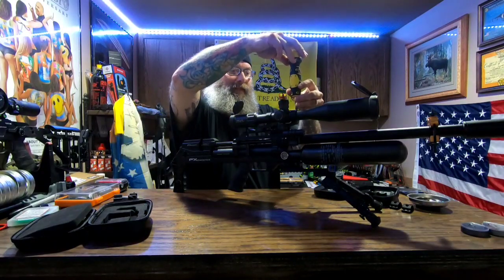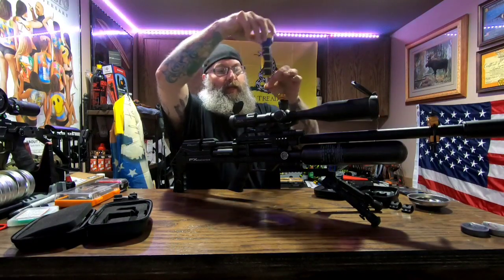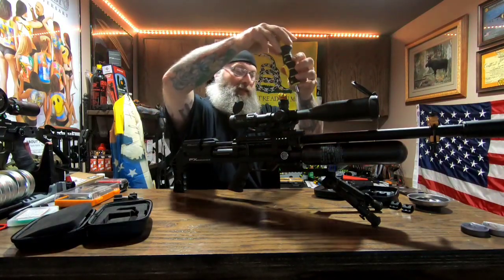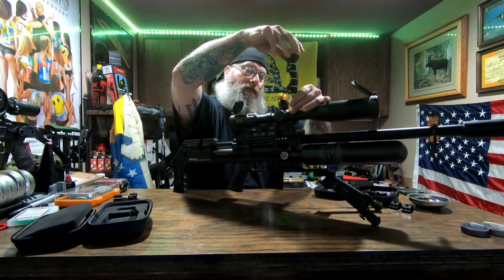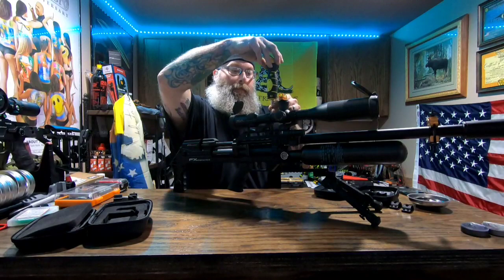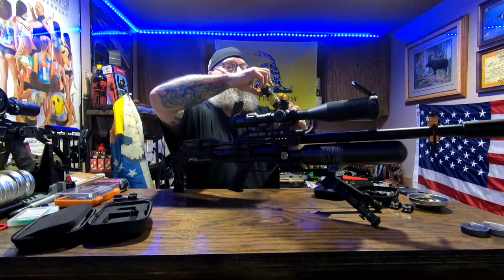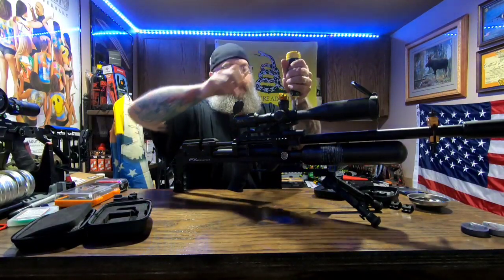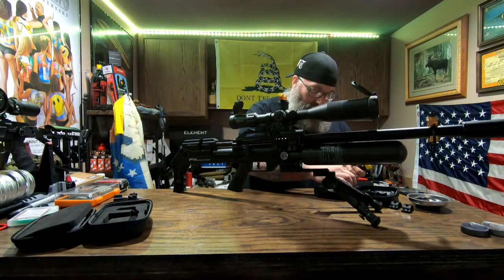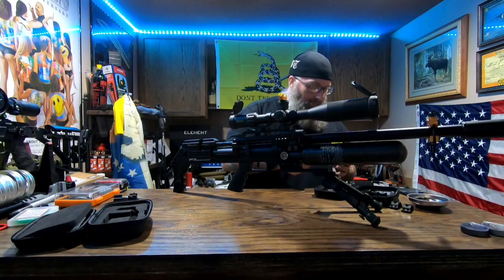So, we're just going to keep going in a crisscross pattern until we get to a point where the Wheeler inch-pound screwdriver actually starts telling us, hey, you're at 15 inch-pounds. And then we're going to know it's time to stop. All right. So we're just going to keep going. And we've got to get pretty close here. Oh, you know what? That might have been my fault. No, that's the right one. Yeah, that's the right one. Is it?